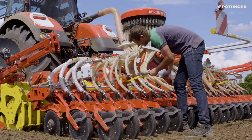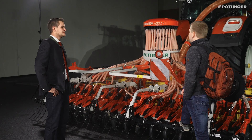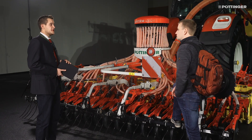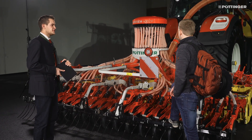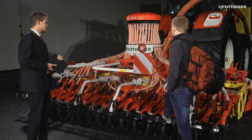The coulter pressure can also be easily adjusted for each side using the ratchet wrench. And at the rear, we have levelling tines as an option. I do a lot of contract work for other farmers — what about tramlines? Do I have to change hoses around? No. As a Pöttinger customer, you have several options. As standard, the distributor head is set for a specific tramline with motors at the outlets. But you can also integrate a motor into every outlet — we call this a full IDS distributor head. This lets you use different tramline widths and wheel widths, ideal for contract work. For example, a 21m tramline with a 5m machine width is no longer a problem.